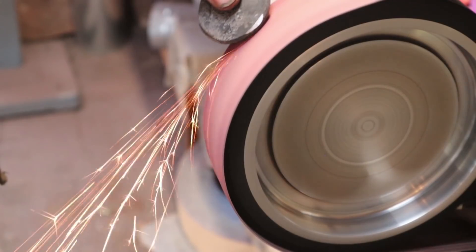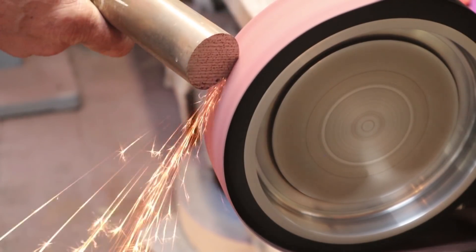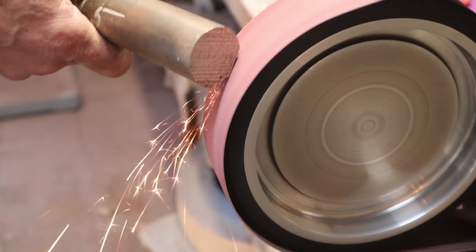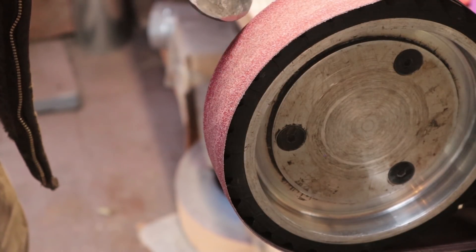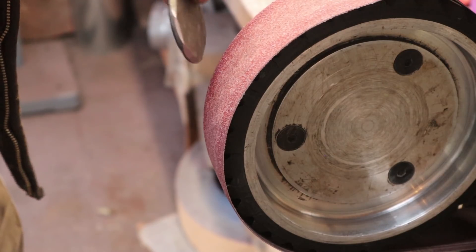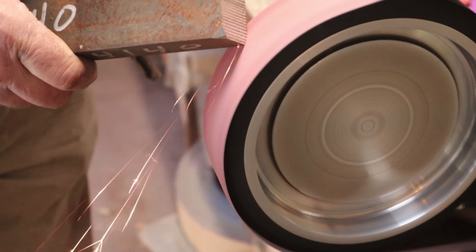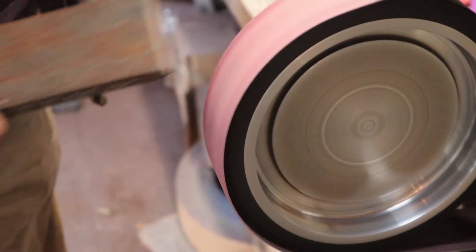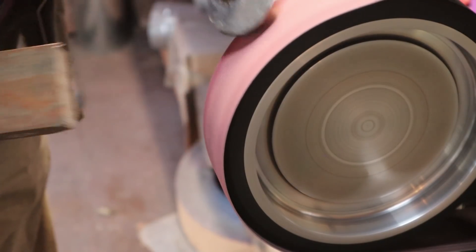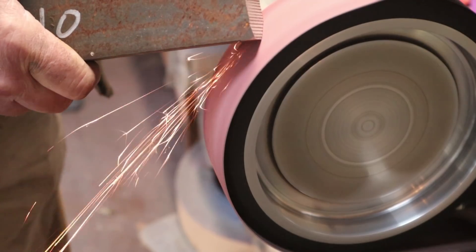Let's try it against some 1045. That was perhaps closer, but I think the 1045, even though it's relatively low carbon, still seemed to have a brighter spark pattern than this did. But closer than a lot of what we've looked at. The last thing I have is a hunk of 4140. Spark testing is very subjective — you have to evaluate sparks, and it's hard to see them exactly side by side. It might actually be easier on video than it is in person, because of the angle of the camera and the magnification on screen.